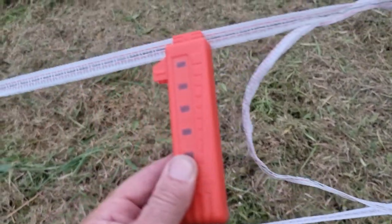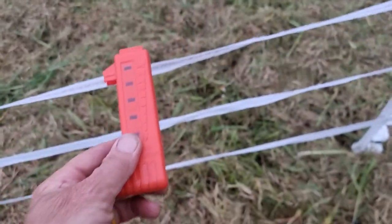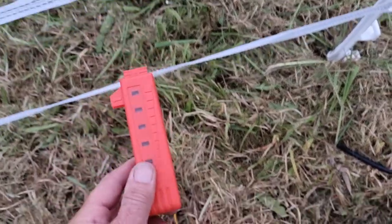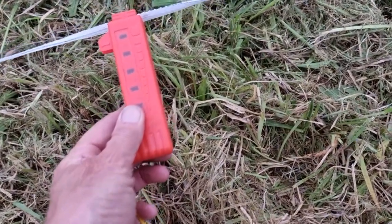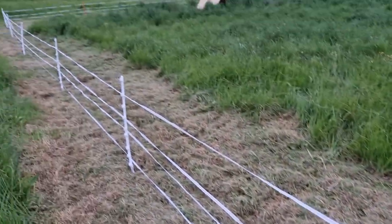The electric fence, I think it was originally designed in New Zealand. That's a tester there. We got a spark or not? Oh, yep, top one's going right. That one's going right, and this one will be going right too. And there's our earth down in there. So a tester has an earth as well. And how it works is, well, you can see how it works. It goes in the battery and the sheep touches it, earths it out, gets a belt.